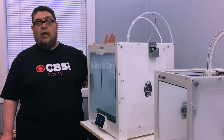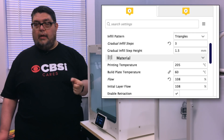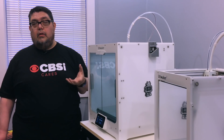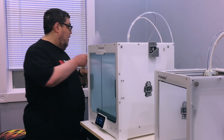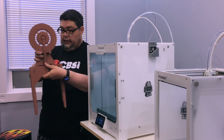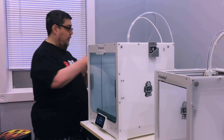I've used some random filament I had sitting around, and with the exception of one problem, I had not a single filament fail — just one build fail in the entire time using the printer, and that was my fault. I put in the copper fill, which is copper-infused filament, and didn't read the manual. ColorFab recommends you change the flow rate from 100% to 108%. I didn't do that on my first test piece, so it stringed up. Once I read ColorFab's instructions and changed the flow rate, I was able to print this incredible Star Trek Discovery piece — just an incredible print with not a single error, which is astonishing for something this big and complex.